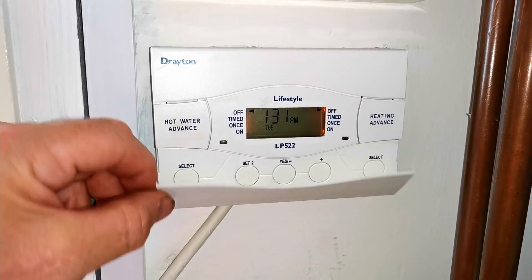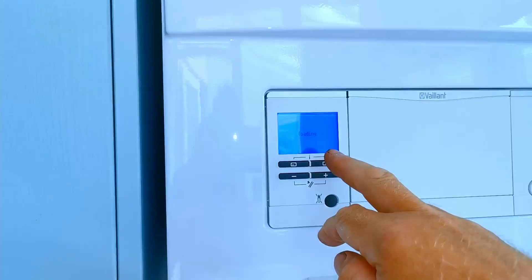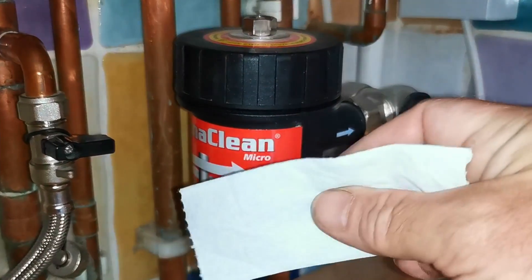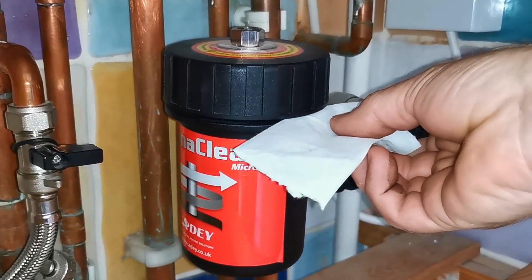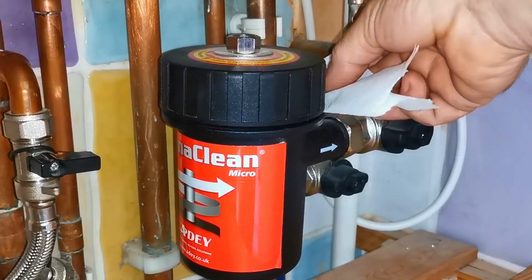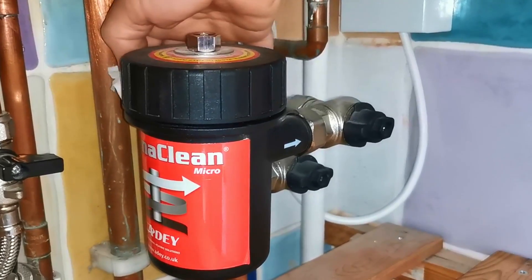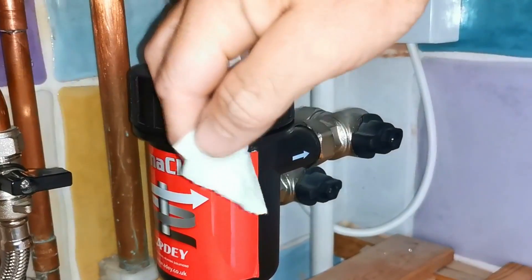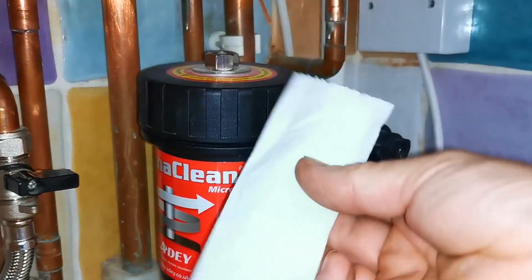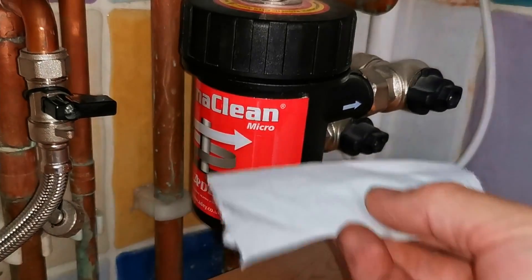Put your power back on again and switch on any controls, and turn on your combi boiler. Just check to make sure there are no leaks. The best way I've found is to dry it all off, then get a dry piece of kitchen roll or toilet paper and put it in the edge of the lid, wiping it all the way around inside the lid edge. Any drops of water will show up straight away with a little mark. You may need to do this several times, or come back an hour later and check it has all dried up with no sign of leaks. You can see that it's completely dry, so I know this lid is not leaking at all.